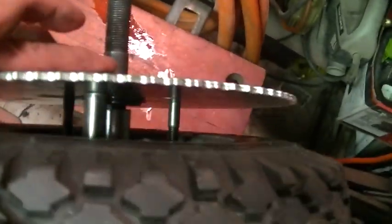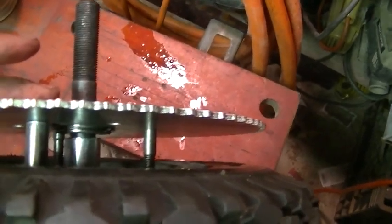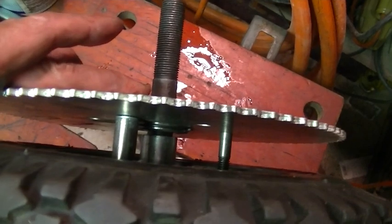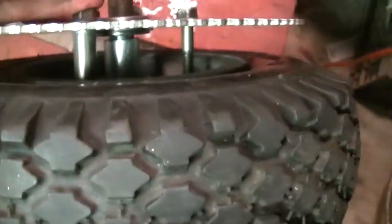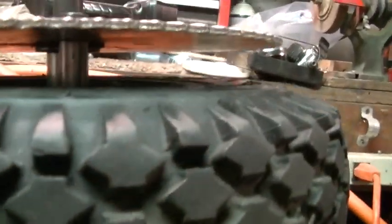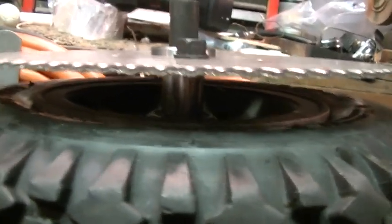I just got to go by how flat it is there. We got a bushing - it doesn't really look like it's square. Let's take a little bit off of this and get it down so that it looks like it's fitting just like the spacer does - just right. I also squared off that bearing a little better - the inside spacer. So now I've got to make five more of these and we should be good to go.